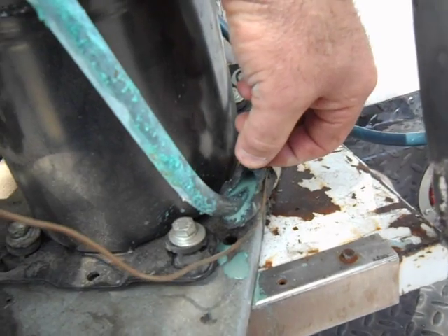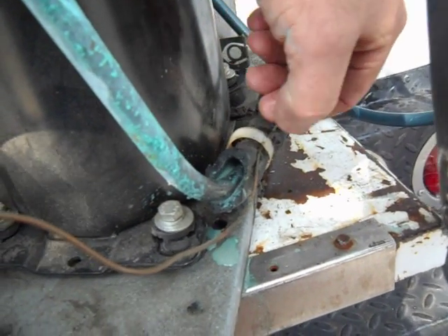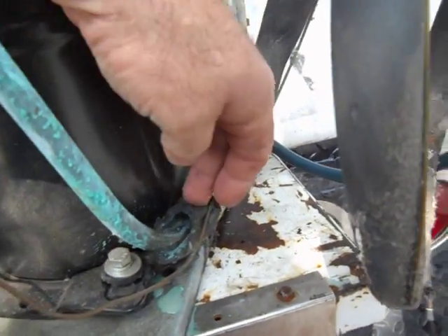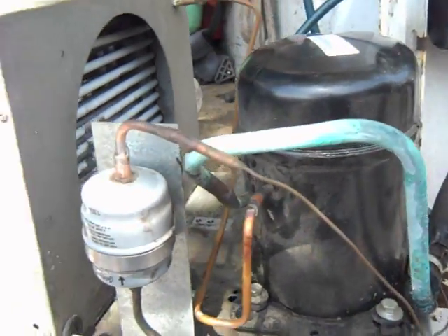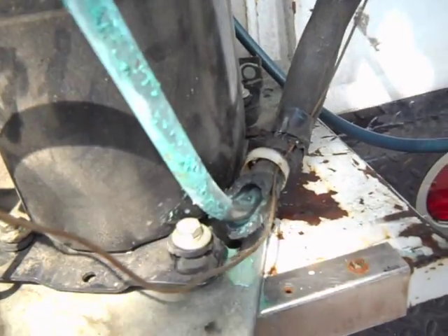This is someone's way of cheapening out — that looks like about three-eighths inch, which is air conditioning thickness. The inside diameter also wasn't the right size, so that's why it's full of water. You can see the pipes are all green, which makes for corrosion, and that's how you get leaks.